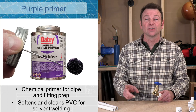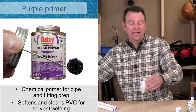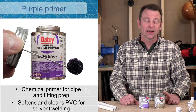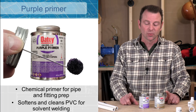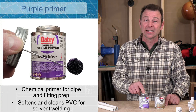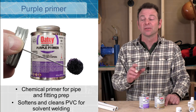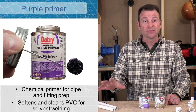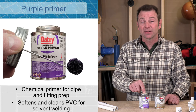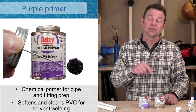There are a couple of installation materials we need to go over that will help us install PVC pipe — that is our glue and our primer. The fittings and pipe slip together but we need to prep and glue these joints before they're watertight. This is a two-step process. We start with a purple primer — it stinks and it's dyed purple so that during an inspection of your plumbing system it's very obvious that it's been used. It not only cleans the end of the pipe and the inside of the fittings, it will also soften the material so we can then add our cement.